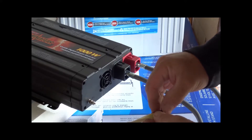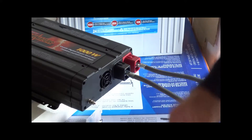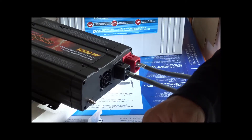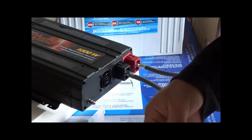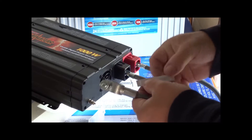Do not hook it up to the battery yet — just tighten it up, being careful not to torque things around. Hold it in place, put that cover back, and get out your negative sticker. Doing this labeling is really important, especially if you're installing in a vehicle or a boat. So there's our negative cable ready to go.